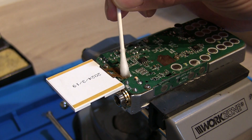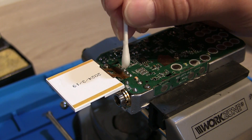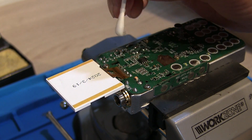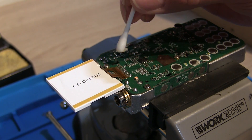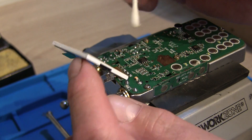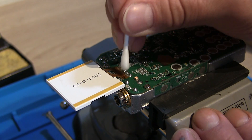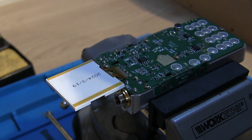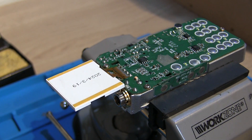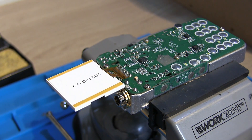I've cleaned up the pads, applied a tiny amount of solder flux and some solder paste, and applied a little bit of flux to the underside of the screen ribbon cable just off camera. That seems to have made a fairly good connection. So before we put it all back together, I'm just going to test to see if that screen actually works first.